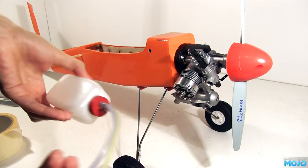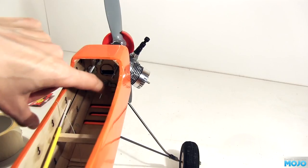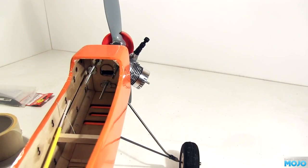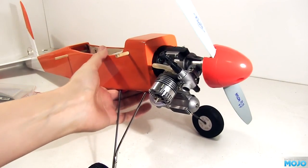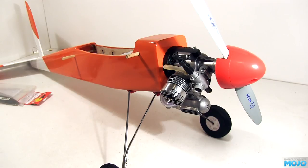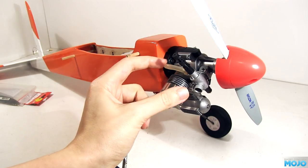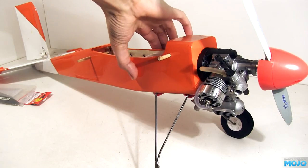We still need to fit the fuel tank after all, and those screws do kind of get in the way, and we need to get the throttle into the fuselage. Well, maybe I'll cheat a little bit. I've swapped the long screws for some cap heads and washers, and loctited them into the blind nuts. The mount is now as close to permanent as it ever needs to be, the fuel tank is in, and the clear tube goes to the fuel pickup, and the blue tube is pressure.